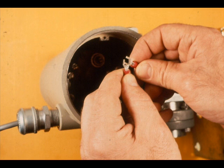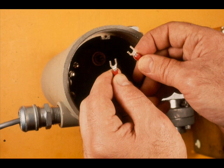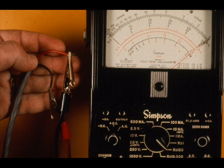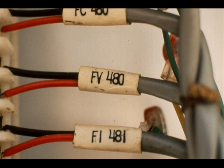This is a schematic representing the circuit you use to identify wire pairs and verify continuity. Ask the co-worker to make and break the circuit to verify the identity of the pair. You can use a VOM in place of the buzzer — put the VOM on R times 100. Attach the leads to the cables; one pair will indicate a closed circuit.